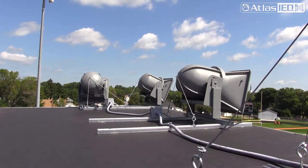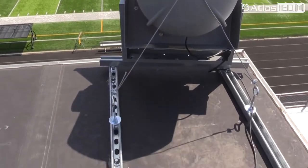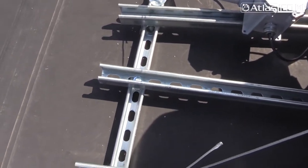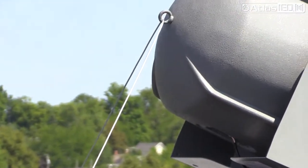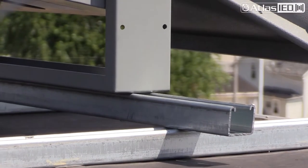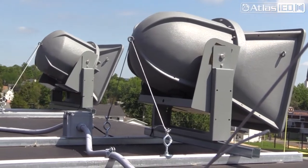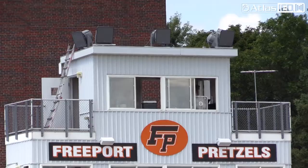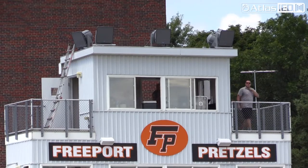With the H-series stadium horns utilized here, we were able to use them on a flat roof situation with some unistrut and basically bracket them down, using some eighth-inch safety cables on the back to help tension and secure. It's a U-bracket situation where you just mount it down, bolt it up good, get your angles out to your points of delivery, and just do some tweaking when you're done. Overall performance and coverage were spot on.